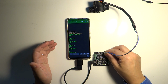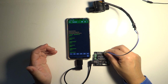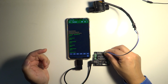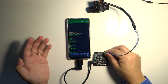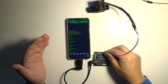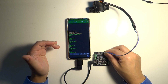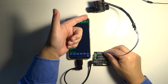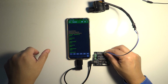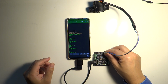So if your sensor only activates at a certain transition, say low to high, all you have to do is take the number divided by 2, because these numbers are almost always even numbers, unless somehow the rotor settles at a location where you only went from low to high and never went back from high to low. That could happen because the rotor is not detented like a rotary encoder that will always fall into a detent that finishes the whole pulse.